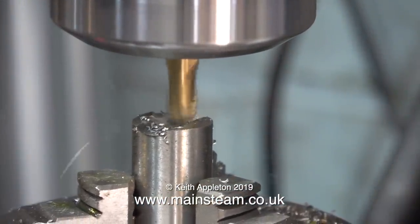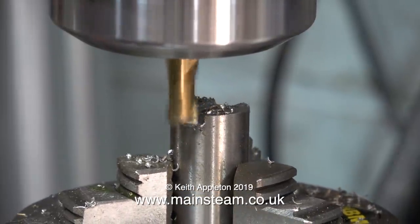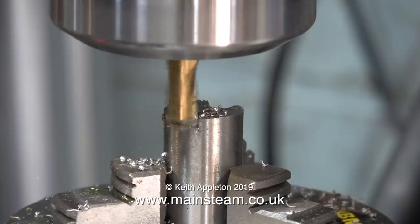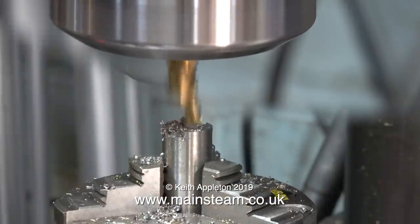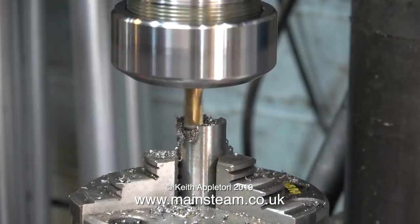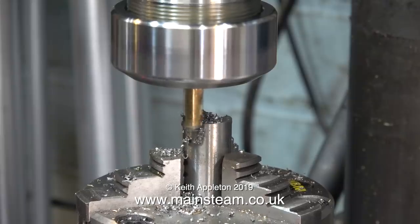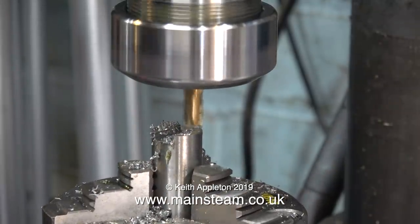When you're buying tooling, you have to buy tooling relative to your pocket, but all I can really say is if you buy the best, you'll only buy it once. These ER40 collets were not expensive, and they are very good quality — I'm quite pleased with them. If only the chuck had a slot for a spanner on the main body of it, then I could hold it solid while I tightened the collet in position.